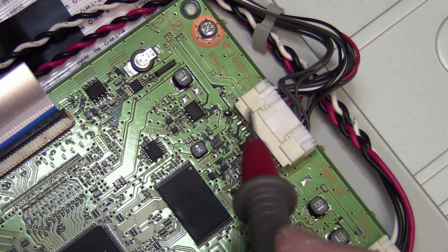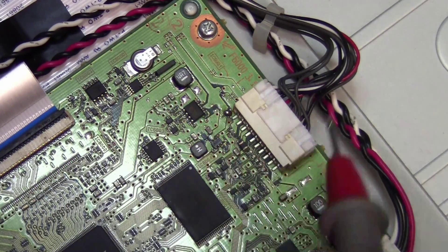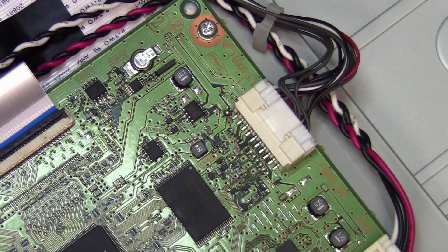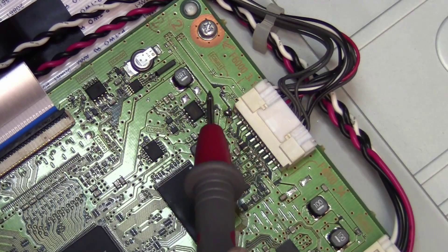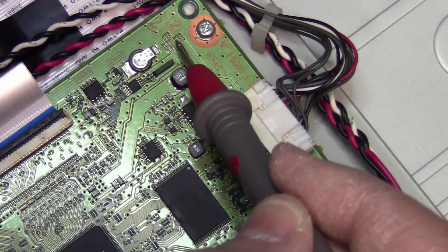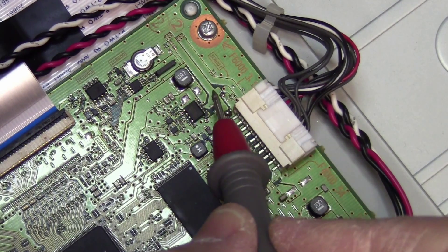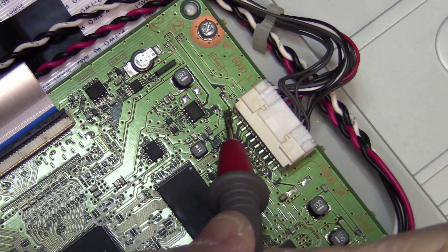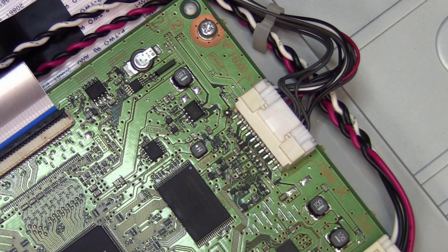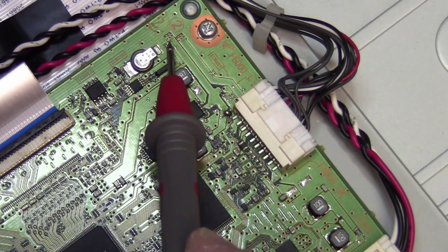So I looked at the obvious few components. There's this little capacitor over here — that turned out to be okay; I've put that back in place. Then there was another little capacitor — basically, we had a tiny little surface-mount capacitor sitting across this track from ground to this rail, which was basically pulling this rail down. So what I'm going to do is put a small surface-mount capacitor in there. I'm going to check the circuit diagrams to see what the value was, because the capacitor itself wasn't marked, and then replace it. After removing that capacitor, I temporarily bridged the fuse and the TV does now power up. I don't like bridging things out, so I'm going to get a replacement fuse and a replacement capacitor.